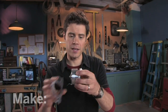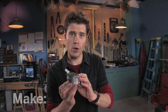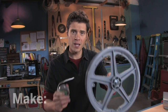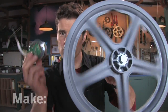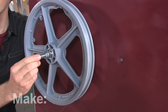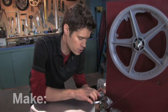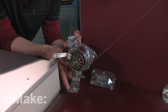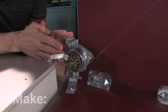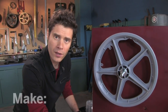The question is how can I get this sensitive little high-speed motor to drive a cat feeder? If anything gets in the way of this thing's speed, it can shut down the whole system. The answer is a pulley. Just like gearing down a bicycle when you go uphill, this is going to reduce the angular velocity of my motor and increase the torque. Over here, I've got a frame made out of plywood — it's been given a nice coat of paint for looks and I drilled a hole through it so that we could mount a bolt as the axle. This has some nice bearings in it so we shouldn't have too much friction. Down here, the motor is attached to its mounting base and then an old aluminum ruler is being used as a bracket to get just the precise angle I need. As a belt, I've got some stretch magic cord, just looped around here and tied in a knot with a decent amount of tension on it. Tie your stretchy cord with an overhand knot to keep it secure.